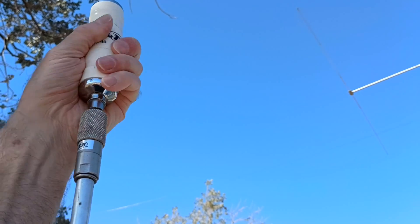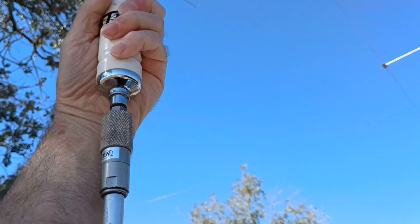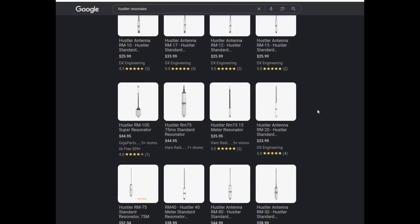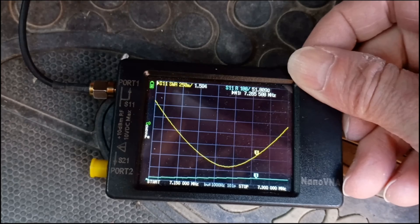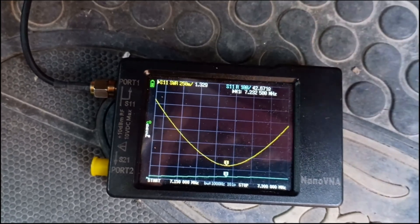The Quick Connect is an option that allows you to remove the resonator and stinger with a quarter turn. Resonators are available for 80 to 10 meters with the 54-inch mast, without the Quick Connect and without the spring, supposedly being able to resonate on 6 meters — and we'll talk more about that in a second. At this frequency, the inductor is taking the place of more than 70% of the antenna, but it does get you on 40 meters in a mobile platform.